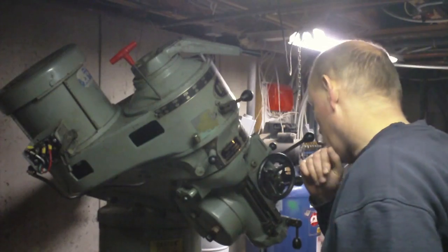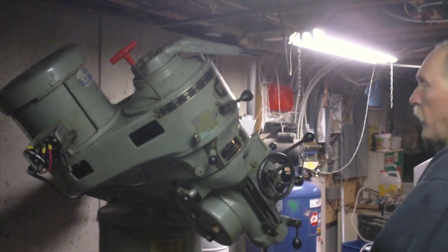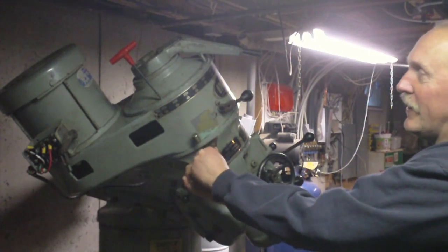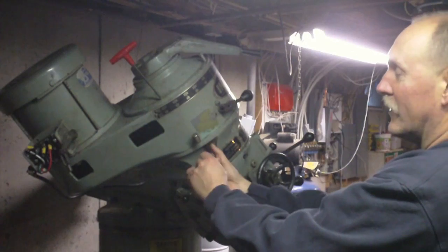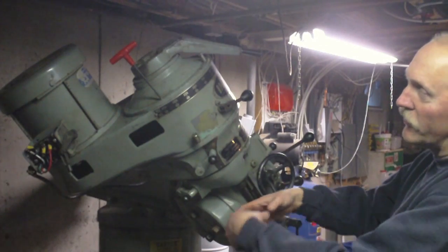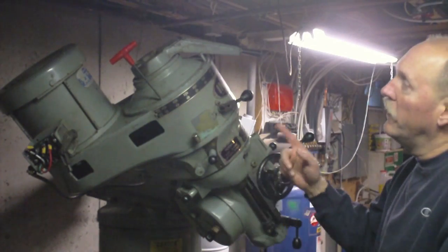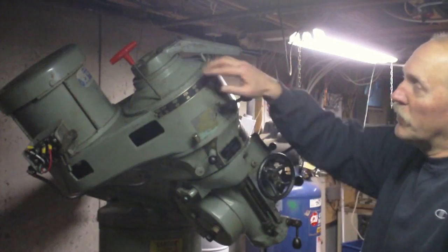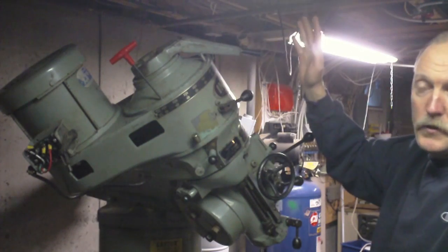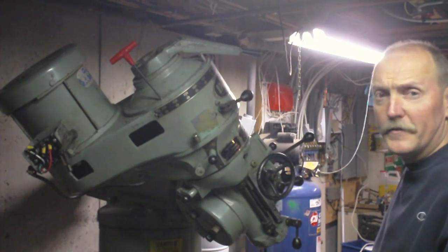It's been a couple more days and I know I have to deal with that broken spindle. Now with the quill and everything out, I'm still realizing there's a problem here where this is not engaging — it's still binding. What I'm thinking is if I'm right about it being that special locking nut on top of the big gear not clearing properly into that upper part, it should be easy enough to determine by taking this cover off, removing that nut altogether, and seeing if the problem completely goes away. If it does, I'll take a good look at how that nut fits in that assembly.